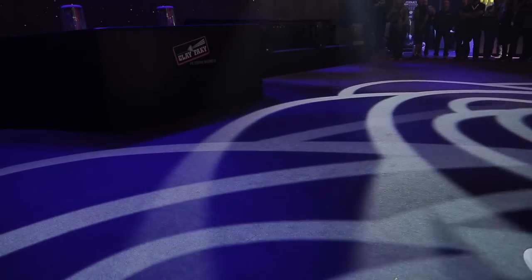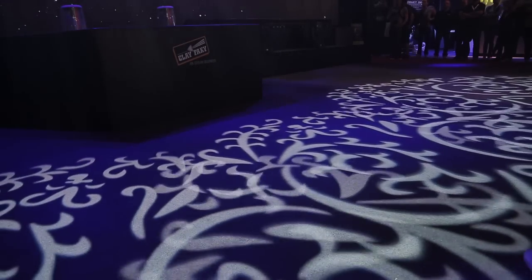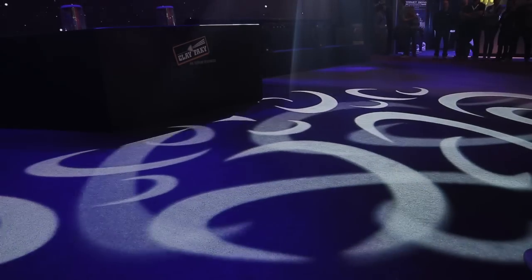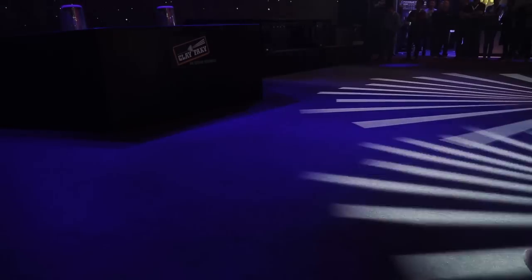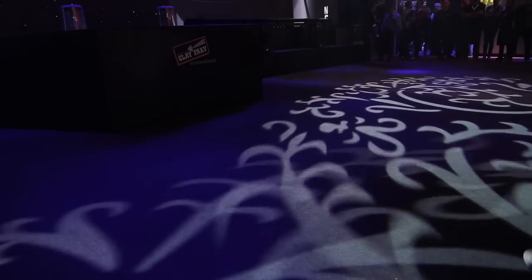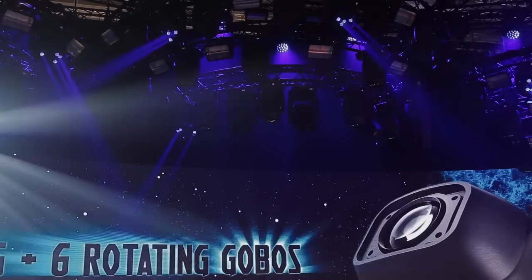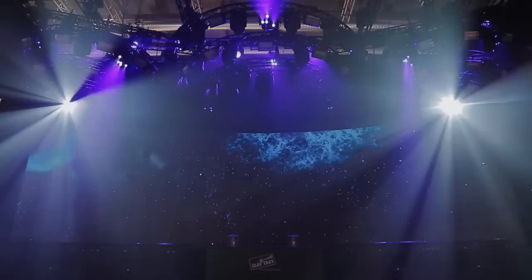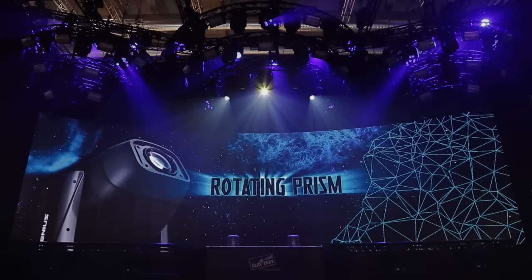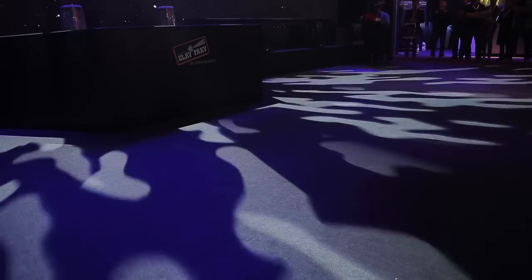This beautiful light is projected evenly through a 142mm front lens. Zooming goes from 8 to 55 degrees with an excellent 1 to 7 ratio — the zoom speed and smoothness are truly amazing. Xenius features a wide range of visual effects devices. There are 12 glass gobos on two wheels that can be superimposed. All gobos are interchangeable and their rotation is indexable. The projected pattern can be multiplied with a rotating prism, and it may be animated using a special interchangeable glass animation wheel.